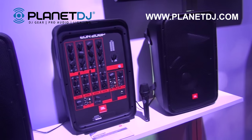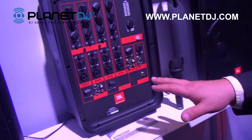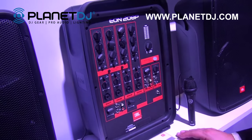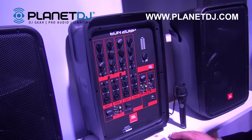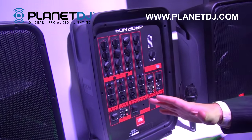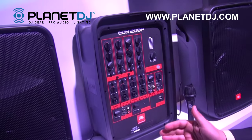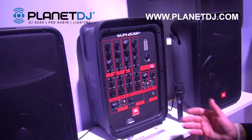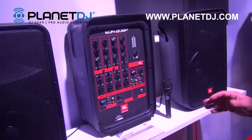What's really great about this is the integrated 8 channel mixer. Channels 1, 2, 3 and 4 are XLR line combo inputs with treble and bass control as well as selectable reverb on all of those. On channels 1 and 2 you have the option for phantom power so you can use up to two condenser microphones. Channel 3 has a high Z input for connecting guitars and other inputs that need extra impedance.